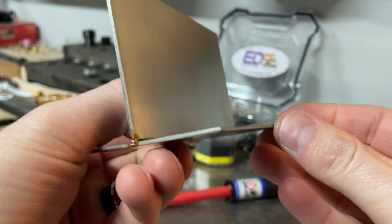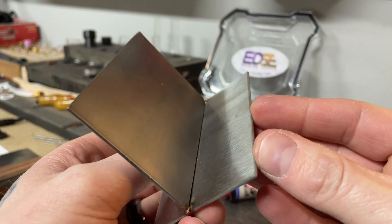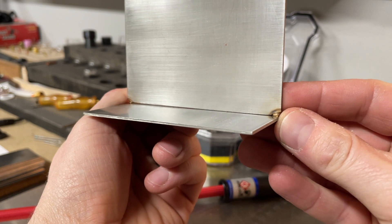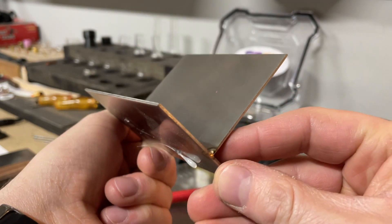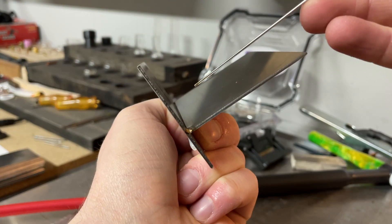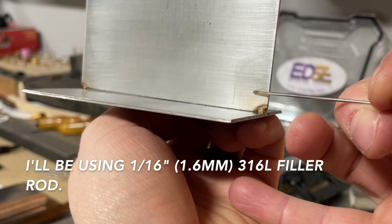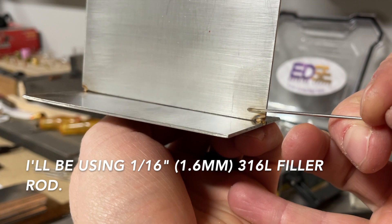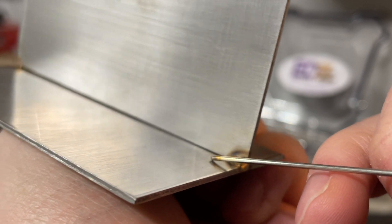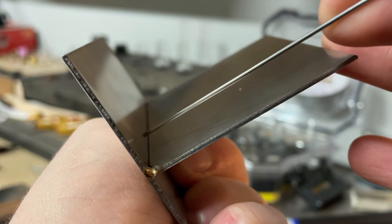This is 304 stainless steel, about 1.6 millimeters thick — about a 16th of an inch — and I've already got it tacked up in the T or fillet weld position. A lot of people set it flat on their table, but for the demonstration today I'm going to have it tilted so the valley of the weld is at about 45 degrees from the plane of the table. When it's flat you have a high side and a gravity-affected side, meaning everything pulls down to the low side.